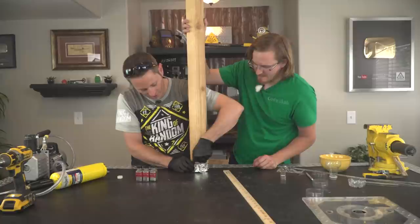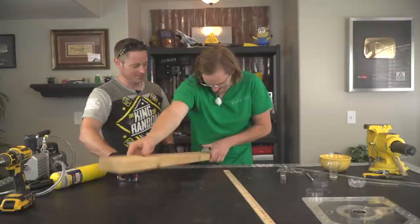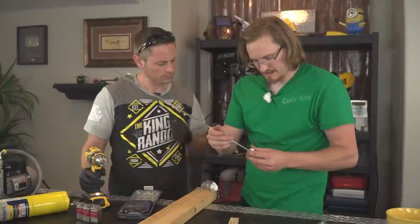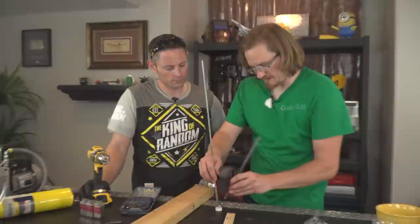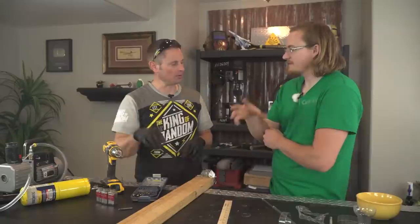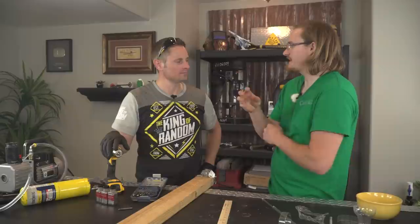Now these should be interchangeable. That's in there pretty good — it sucked down pretty tight. I kind of want it to be like that anyway. We can just pour the mercury in, transfer it in. So I was thinking — if this tips over, the mercury is going to run out. What if we had, off to the side of the main tube, another tube coming off here with a balloon wrapped around it to catch any mercury? That would keep the vapors out too and equalize the pressure. My concern is the balloon would react to the pressure before the mercury would. Well, the balloon can just flex and let pressure in and out without letting mercury through.